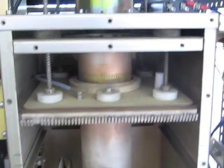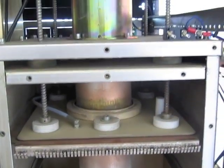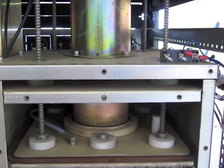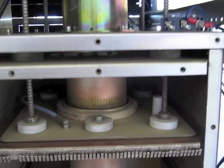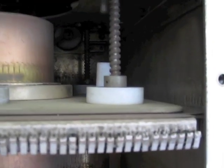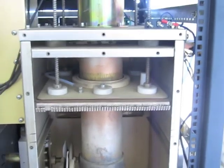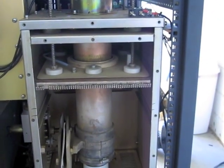The pipe in the middle of the shot, that's the chimney. And there's the high voltage connection. That chimney takes all the hot air off the tube and blows it up out the top of the transmitter, where it's ducted outside. There's a sliding plate with those spiraled threaded rods — that whole plate can move up and down. Another motor turns four spiral rods all together in unison and moves that tuning plate up and down. The size of the cavity actually changes depending on your FM frequency.